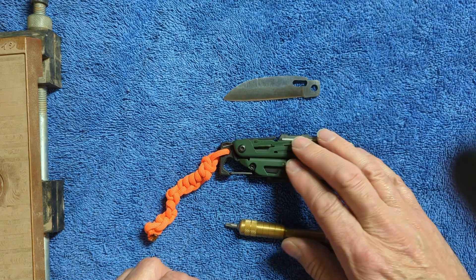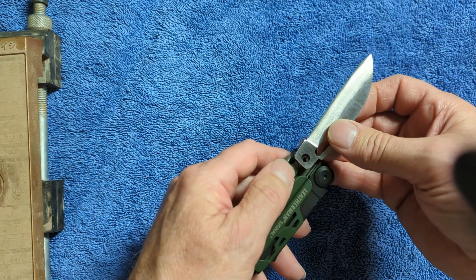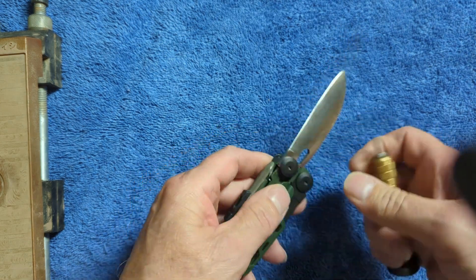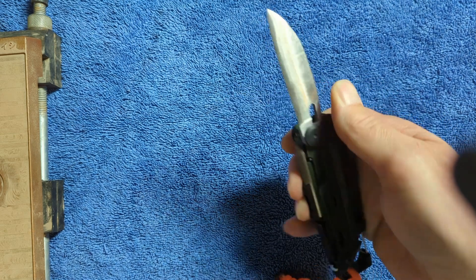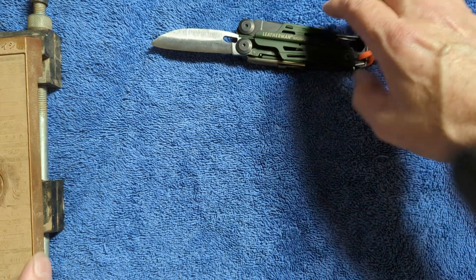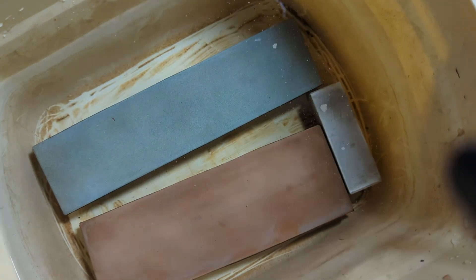Next, we're going to put it back on the knife and then sharpen it. I added an additional washer on here because it helped make the blade more stable. There may be an ever so slight stock thickness — let's get a little wiggle. Let's get this thing sharp. To work on convex blades, I really like water stones. I have my stones soaking in the bucket here. These are double-sided stones, so I have four different grits to work with. These need to soak for five or ten minutes before you can use them.